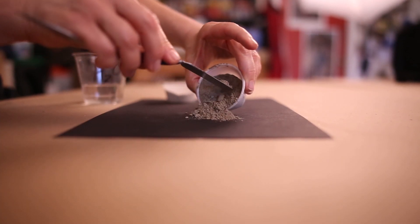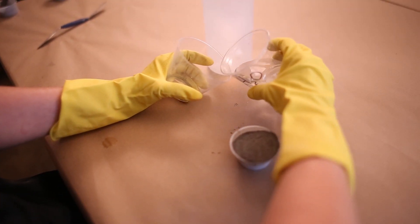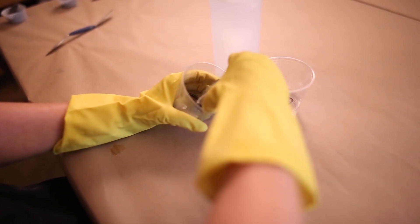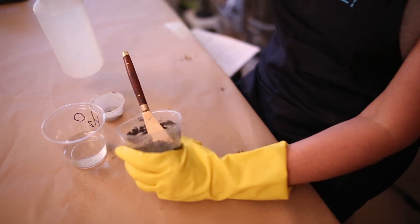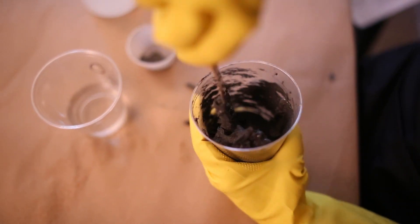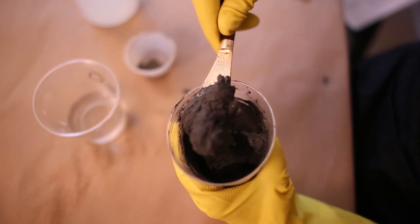White or gray is a personal choice. You should always start with a little water and then add your powder. If you need to add just a touch more water, try using a spray bottle. Allow for slaking, which is a chemical reaction recommended by the manufacturer you allow to have happen. Mix your Thinset to a consistency much like a brownie batter — smooth and with some body.